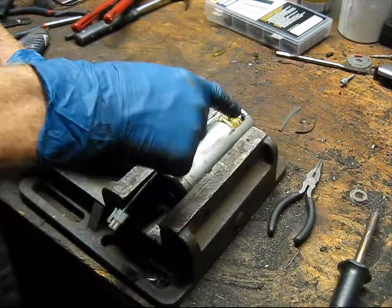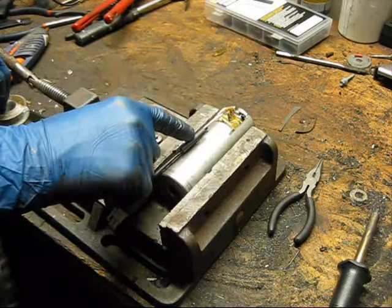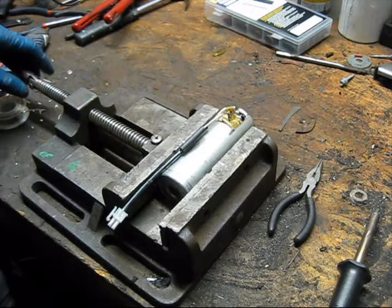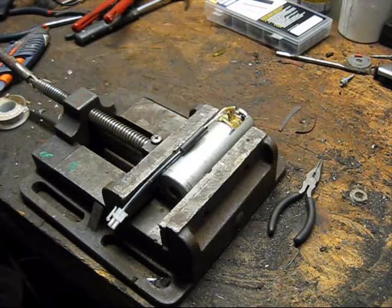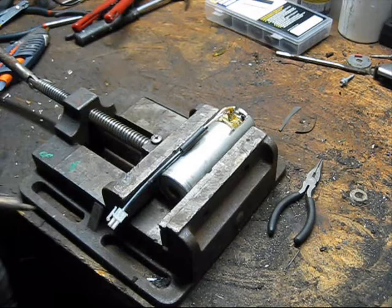I've got both wires stripped and hooked them around each other so I can have a secure joint. I'm going to go ahead and solder them. I already have my heat shrink on here, so we'll be able to heat shrink it afterwards. I'm going to solder that hooked section to get a nice good electrical connection — that's not going to fail. Of course, that's probably not going to be as easy as it sounds, since the wire is not copper. It's not tinned copper. It looks like some kind of silver wire, or tin or aluminum — whatever it is, it's not copper, which in my experience usually means it doesn't solder very well.